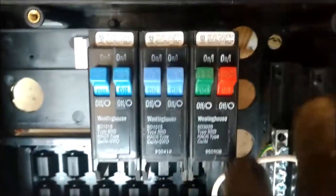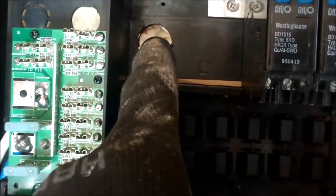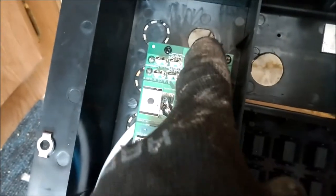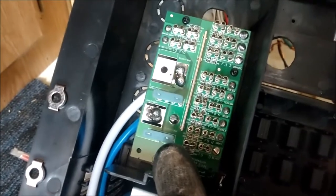Since I already had four outlet wires, I wasn't able to run the power wire through the existing holes. They have holes over here, but there's really no way to get the power wire from there to here. What I ended up doing is drilling another hole right here, and I'll run my main power in here so it's closest to this breaker. I also had to make a small hole in the corner for my chassis ground wire.